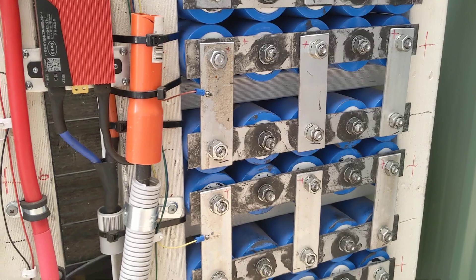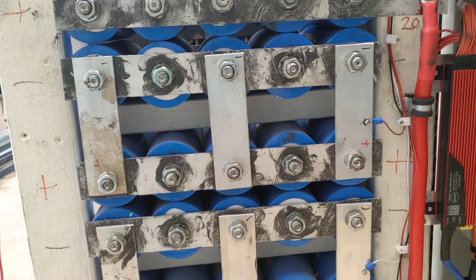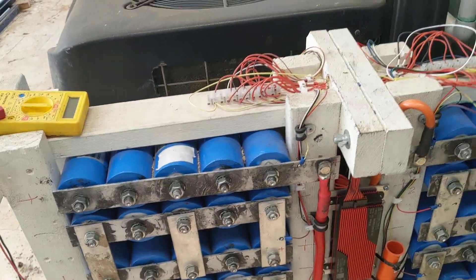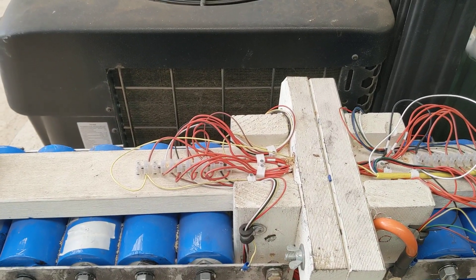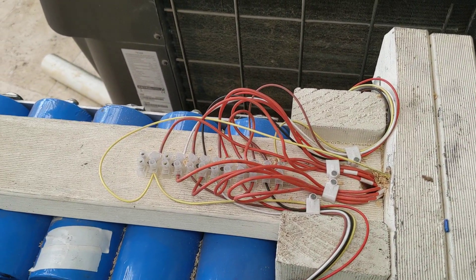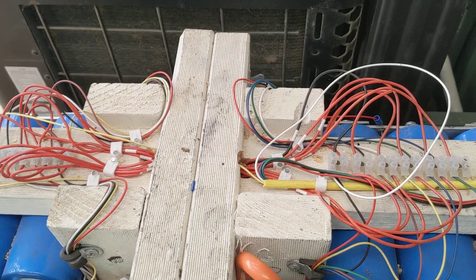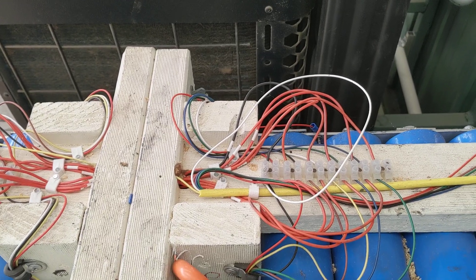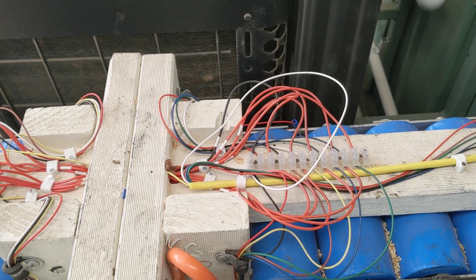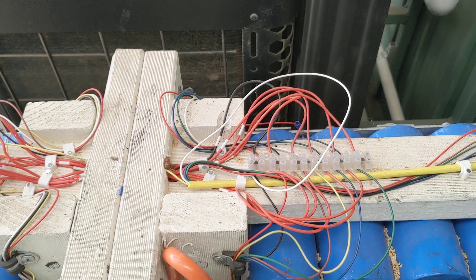These batteries are incredibly robust, unlike the pouch cells I've had problems with. With pouch cells, if everything is not perfect from day one and anything goes out of alignment, they swell up — which ruins your batteries quickly. You've got to keep on top of it. I would always run more batteries than less. With this bank I've been running 20s and I'm moving up to 22s to take a bit of pressure off the top end of the batteries, add a bit more endurance, and protect against overcharge possibilities.